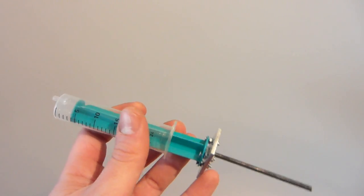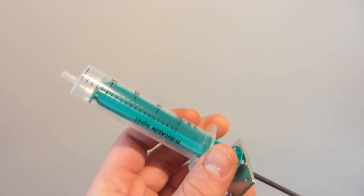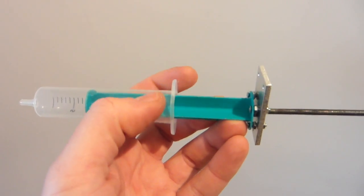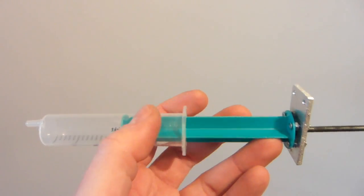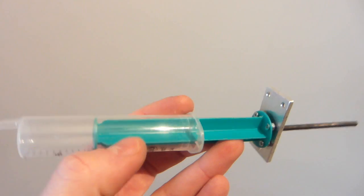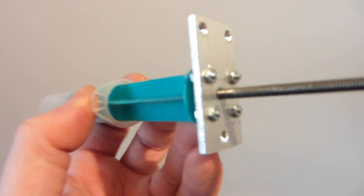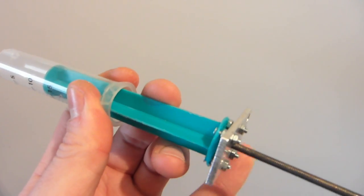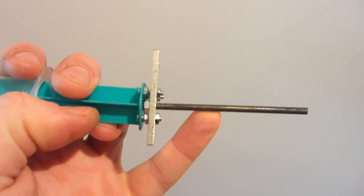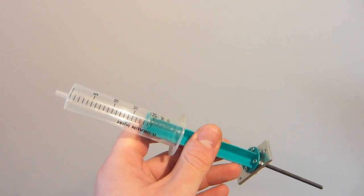So to make sure you have everything you need knowledge-wise, and we are all on the same page, this is one of those syringes. One hole on this side, one hole on this side, and it's ready to mount. That's all it needs. And yeah, for the inner part, this works too well. Make it a bit tighter. Sand down the circular part in the front. In the rear, 4 screws, spacers, and 4 nuts to hold it on the, in your case, U section. And yeah, then M4 threaded rod for the guide, and yeah, that's it. Now we can work on the rest.